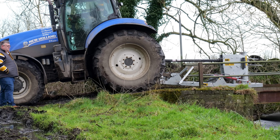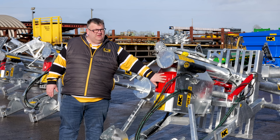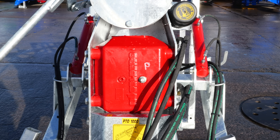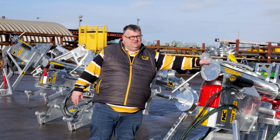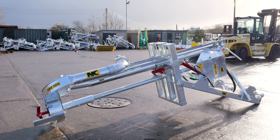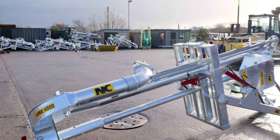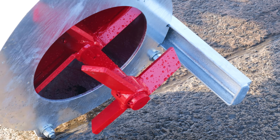One other difference: this is a much heavier gearbox and it's rated for a 1000 shaft. Your standard pumps down there are on a five-inch main pipe, but when you get into the 3800 and the 4800 you're into the six-inch main pipe. You can get this to a safety slot, but because of the bigger bottom on it, it's increasingly difficult — it is hard to get in and out of a standard safety slot just because of the sheer size of it. It can be done and it is done.